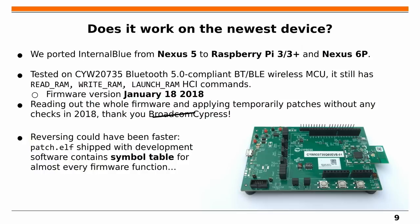People asked whether this works on recent devices. The Nexus 6P has a firmware from late 2014. I decided to buy a development board with a slightly newer firmware. Meanwhile, the Broadcom division was acquired by Cypress, but the same mechanisms are still present. I could use the same HCI commands to modify and extract the firmware. Then, just three days after getting the board on December 6th, I found that someone had forgotten a patch.elf with all function names in the development kit — 11,000 function names and 3,000 object names. Buy development kits earlier.